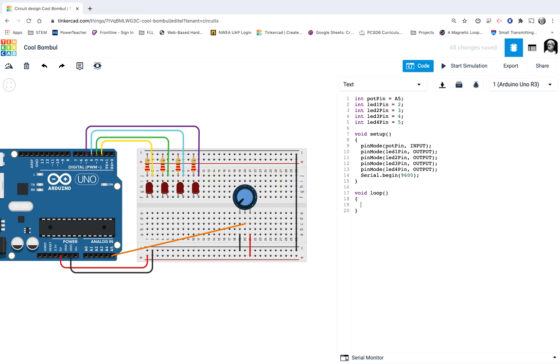Let's just see where those numbers are. I'll make a variable for remembering that measurement — INT, and we'll call it potmeasure. That variable will remember how much voltage is coming back on A5, so we have to read that voltage. That's an analogRead because this is an analog pin — analogRead A5. This is a super important line: I've taken a measurement of A5 and I'm storing it in a new variable called potmeasure. Then I'll Serial.println potmeasure to print it. Let's test our code — no errors.